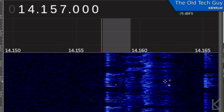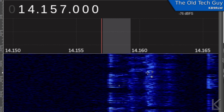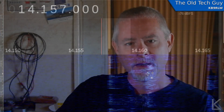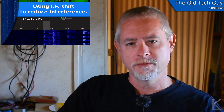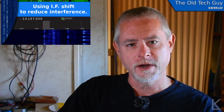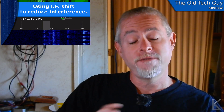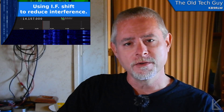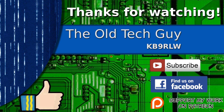That's how IF shift can be used to eliminate an adjacent station's interference from your audio — by just shifting the IF frequency up or down. I hope that explained clearly what IF shift is doing. You'll find this on most older radios that don't have modern DSP chips and advanced software-derived filters. For old radios with mechanical or crystal filters, IF shift is one way you can effectively shift your filter and reduce adjacent interference. I hope you found that informative and we'll see you in the next video. Thanks for watching — if you enjoyed the video, don't forget to give it a thumbs up, subscribe, join us on the Facebook channel, and if you'd like to help support this channel please click to support me on my Patreon page.